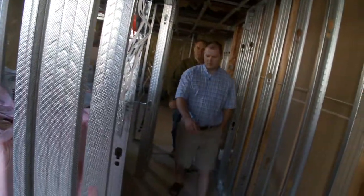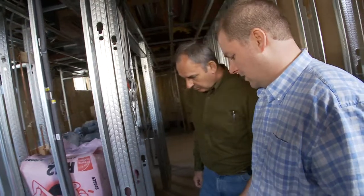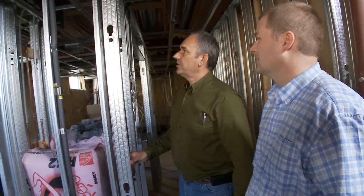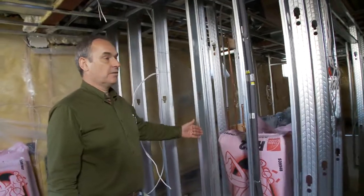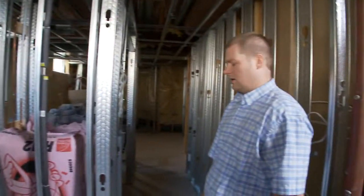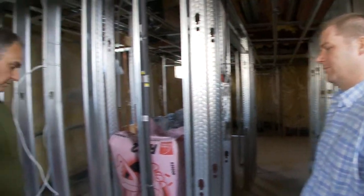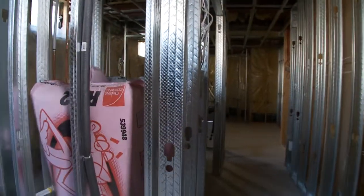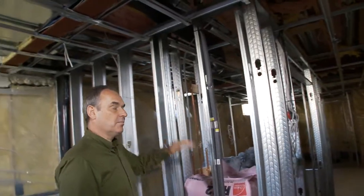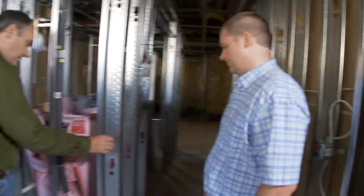I'd like to show you something over here. I'm not quite sure what's going on here — it doesn't look right to me. Are you putting a sunken fridge in here or is this going to be cabinet area? The design actually called for a sunken fridge. So what we have to do is build out the edge so the gable end can fasten to it, and your upper cabinets are all flush on the front above the fridge. We have to line them all up so they look clean, and that means this edge has to be framed out.